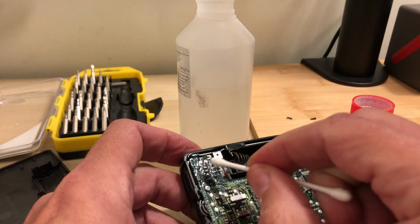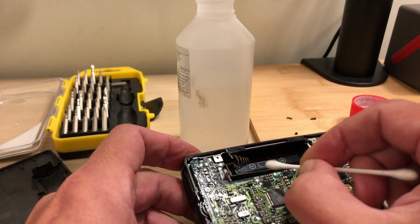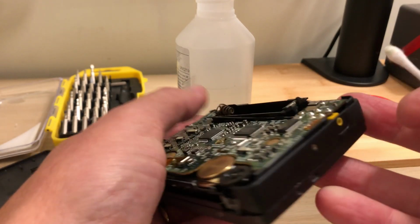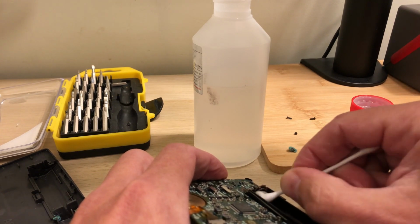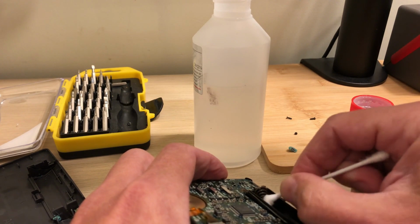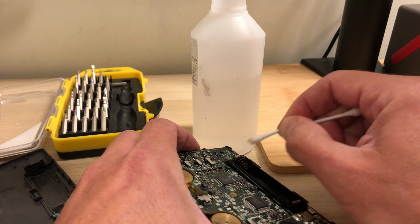At the present time, I probably don't want to take this board off. Well, the board can come out if there's no response when I put the battery back in. Potentially that battery contact there might need a bit of work. Must just be a bit gentle. It's quite a hefty spring, because sometimes when you get corrosion, the spring breaks down quite quickly. It snaps. And this one seems to be a bit hefty. Nothing much coming off here. Probably need to use a file.